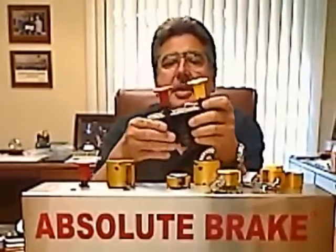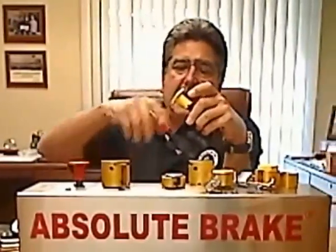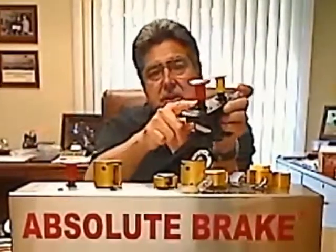Now we go to the AB400L, AB500L, AB600L, AB700L. First of all, these are all designed for the MV3 valves and the PPDCs. We'll talk about, first of all, the AB400L. This one has a bevel on the bottom, and it's specifically designed because this particular MV3 valve has a stop on the shaft. You can just see it right there.